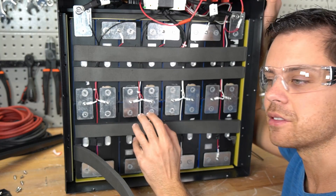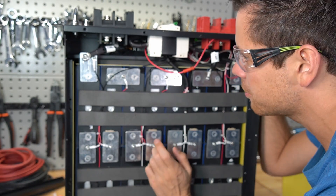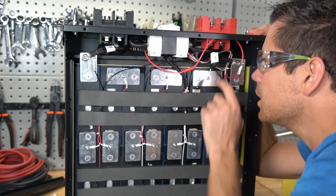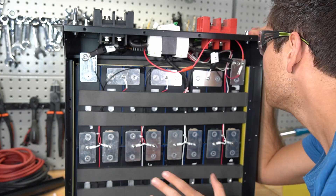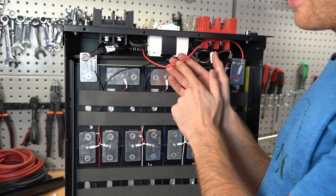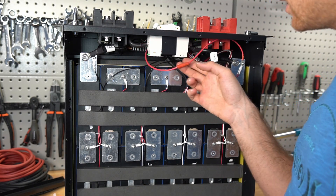CATL cells naturally expand and contract more than others, and there is foam on all sides, so that may have been by design. There's also a massive steel bar across the top so cells don't shift and hit the BMS. Everything on the BMS looks good — every connection is glued, wire management is good, though it could look a little prettier in one spot. To turn the BMS off, you just unplug a connector and it powers the system down.